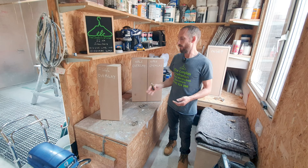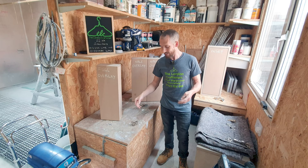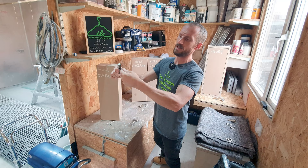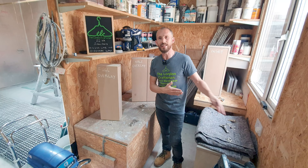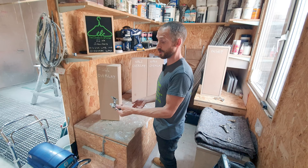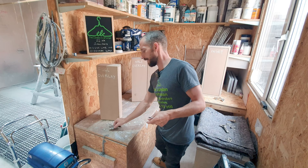I generally use Blum or GTV. I quite like GTV - they're slightly cheaper but you get so much more adjustment in the grub screws compared to Blum. With Blum you can only do half a turn backwards and forwards - it hits a limited stop. Whereas the GTV version has a really decent amount of travel on all the grub screws - you can keep turning and turning and the plate comes in and out a lot more. The GTV slow-close version also has clip-on hinges, which is a bonus.